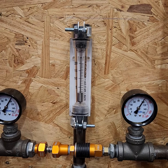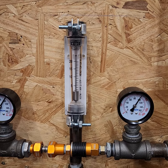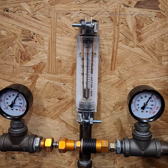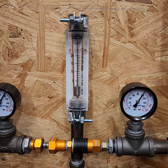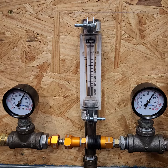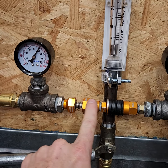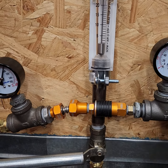So that was about 1 PSI, which is surprising because we're getting almost 1 PSI just with the quick connect coupler and the plug. So it didn't look like this swivel introduced really any additional pressure drop. But I sort of had an epiphany as we were running the test — I realized that the swivel is currently set up to run straight through. So maybe we'll do a follow-up test here.